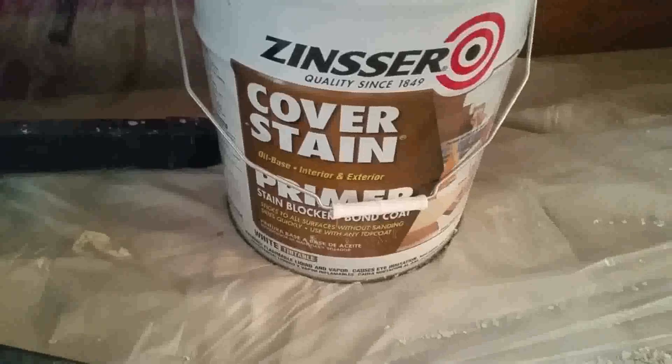We're going to let this dry a little bit, then spray it with sealer and shoot it with knockdown. What we're doing is putting on an oil-based sealer so none of that moisture will bleed through the new knockdown. This is what I use for sealer — never have any troubles.